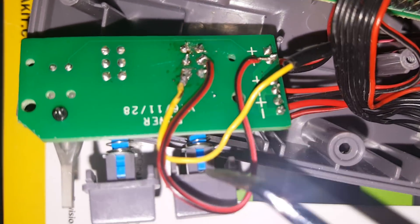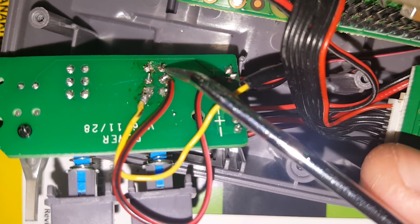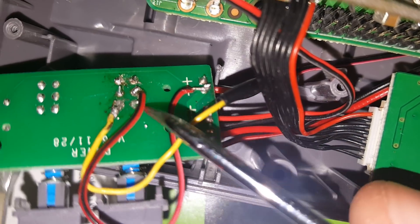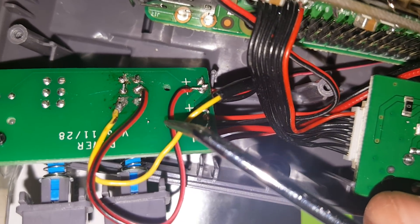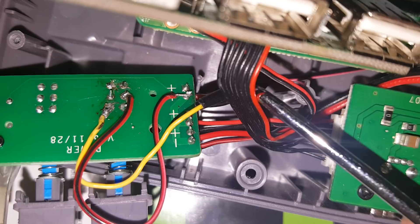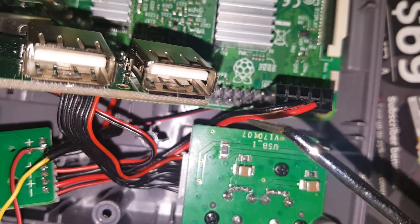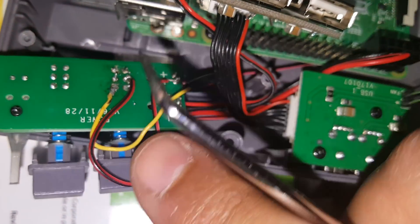All you have to do is take two pieces of wire. With the buttons facing towards you, there are six of them — the power button and the reset button. Take the middle one furthest to the right and make a jumper to the negative right straight across. The bottom-left one is the one going to pin 5. The ground coming from here grounds everything in the same spot — you're just breaking the connection and sending the signal to pin 5.